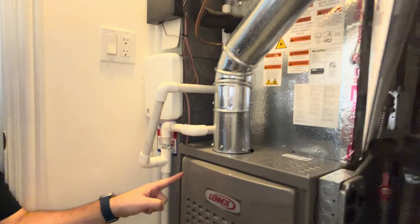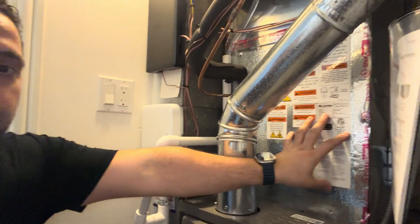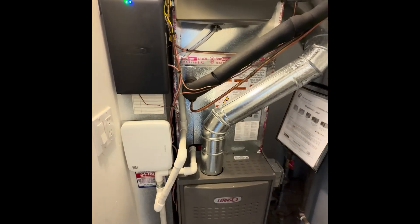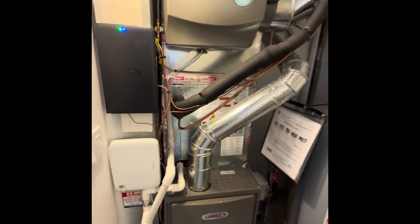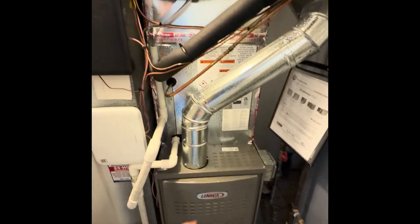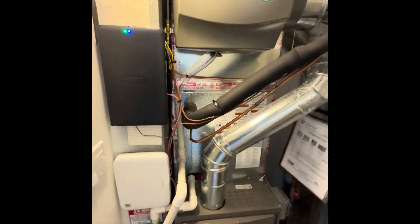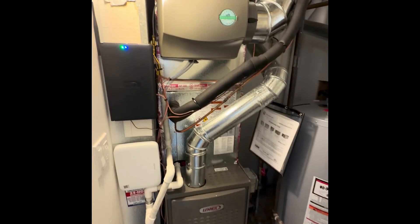So we're in the basement. Here's our gas furnace — it's a Lennox gas furnace that was existing. We just installed the new heat pump and the coil. This is a single stage furnace, which is a good reliable furnace, just not the most consistent in temperature management. One of the reasons to go with the heat pump system is to improve heating comfort, because the heat pump is doing most of the heating by heating the coil above the furnace. All the furnace has to do is run the blower and distribute the heat created by the heat pump, which is variable speed heating, resulting in much more consistent, even temperatures through the entire house most of the year.